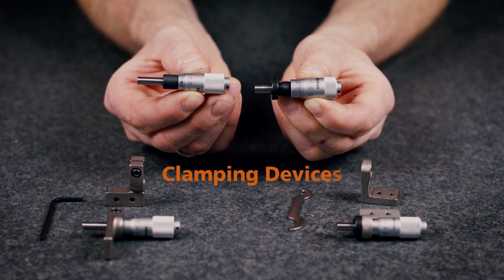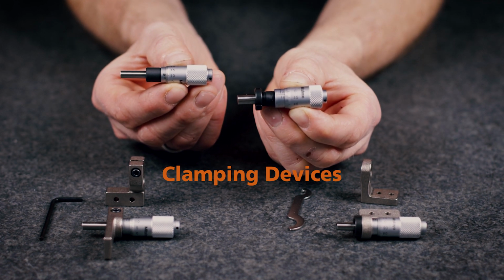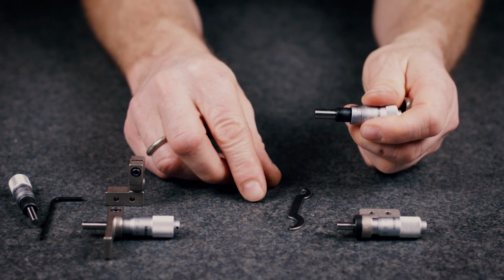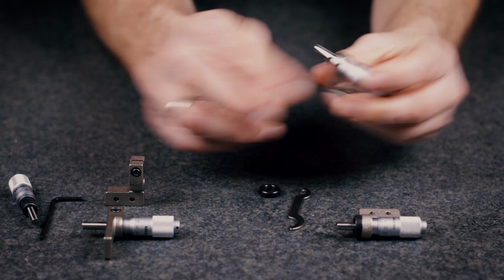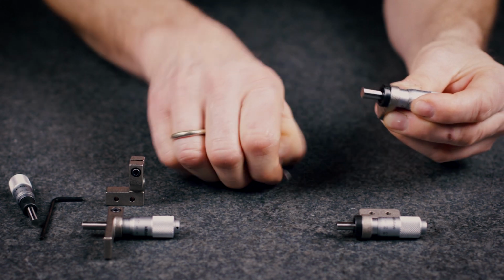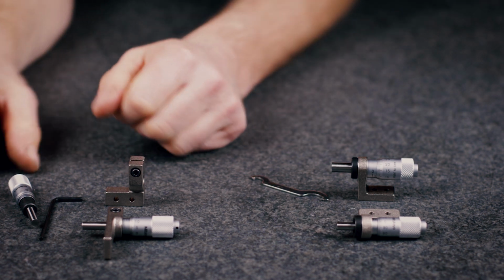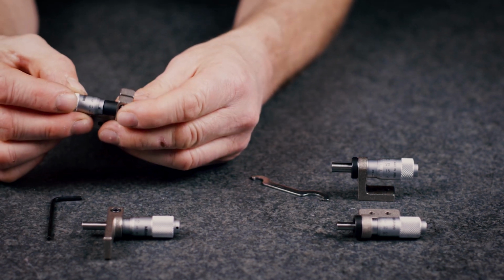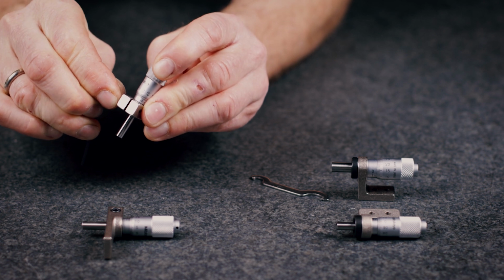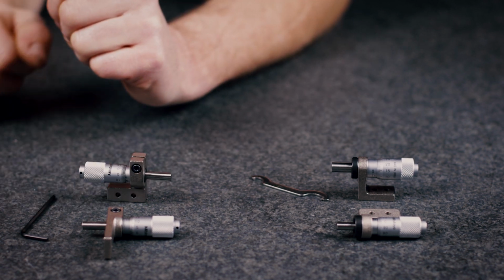The stem used to mount a micrometer head is classified as a plain stem or clamp nut type. The clamp nut stem allows fast and secure clamping of the micrometer head. Whereas a plain stem has the advantage of wider application and slight positional adjustment in the axial direction on final installation. Although it does require a split fixture clamping arrangement or adhesive fixing.